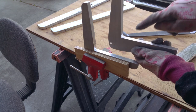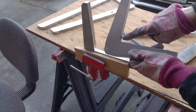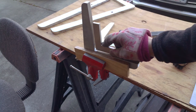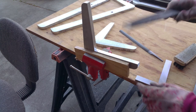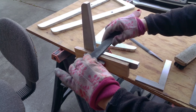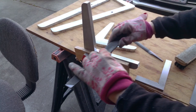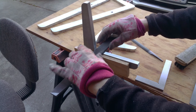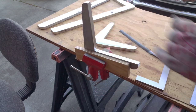They just have a little radius in the corner and it's not totally smooth. I was originally going to drill a hole in the corner of these but I didn't want to take that much material out. I've got a steel square and I'm fitting it in the corner like that. I've got a couple of files and I'm trying to straighten it out - doing a little draw filing and a little regular filing. I'm trying to keep it flat, trying to get the file balanced just so to try to keep the surface flat.